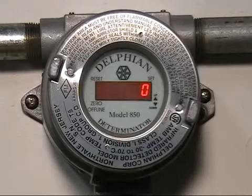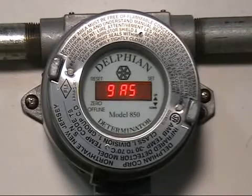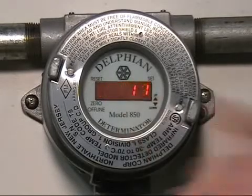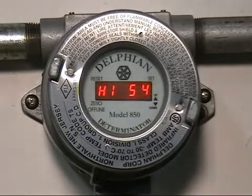And now we're going to put on fifty percent methane. Even though we don't need to do this, a lot of people like to prove that they're seeing gas and that they get the right concentration. Now because we're forcing the gas in at a very high speed, the extrapolation factor of the software allows it to go up to a hundred percent. But as soon as the gas stabilizes out, we get the reading of fifty percent as we expected because we just calibrated.